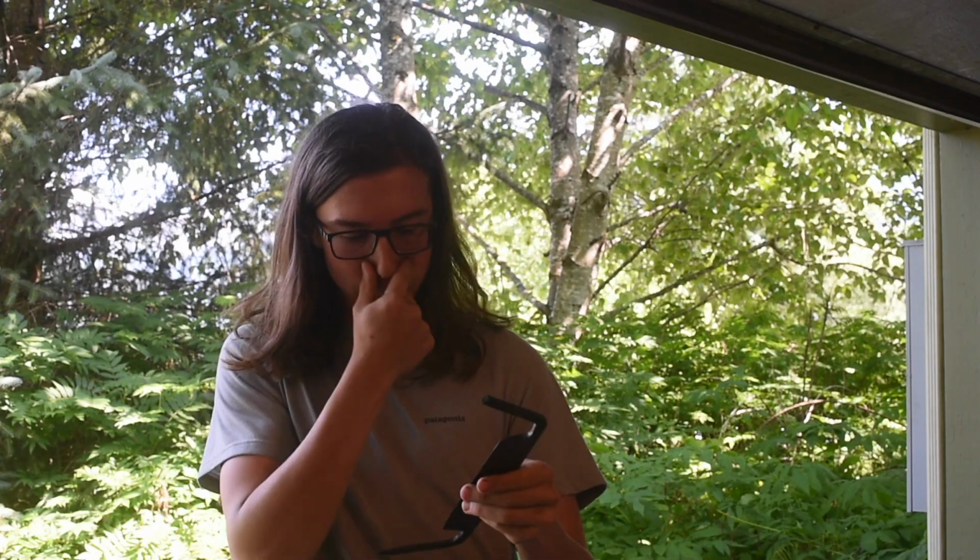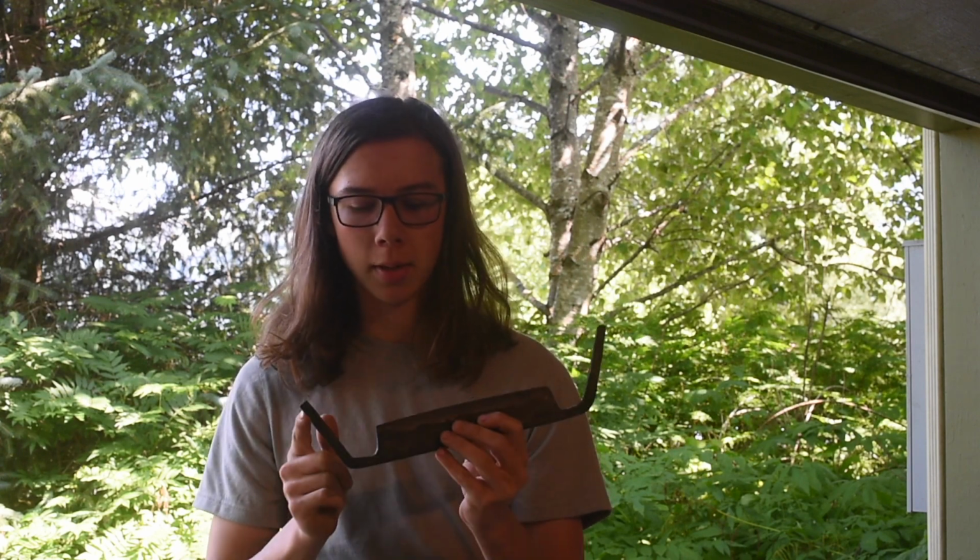Alright, here's the draw knife out of hardening and tempering. I did 2 tempering cycles for 1.5 hours each at 400 degrees Fahrenheit. So we're going to flatten off the back, grind the bevel in, get it down to sharp, all polished up, and then we'll move on to getting the handles made and put on there.